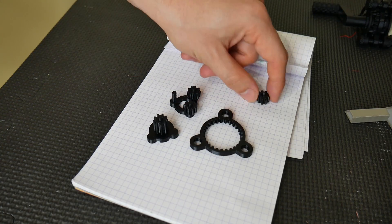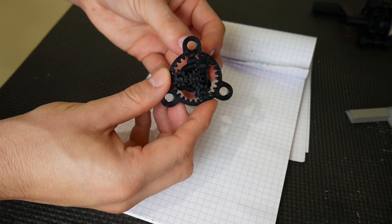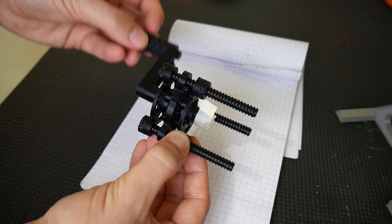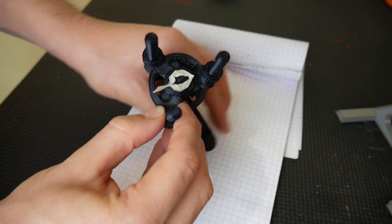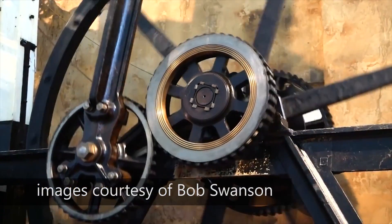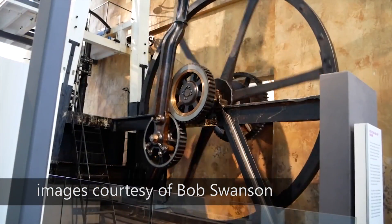This is one of my favorite 3D printed examples of a planetary gearbox, downloaded from Thingiverse — link in the video description. It has a gear reduction of 4-to-1 per stage, and you can have as many stages as you like daisy-chained together to get your desired speed decrease and torque increase. In the end, the patent for the more efficient and cost-effective crank did expire and James Watt adopted it into his steam engines instead of the less efficient Sun and Planet gear.